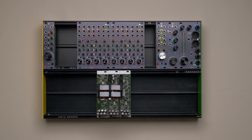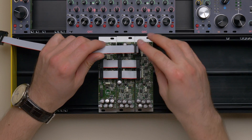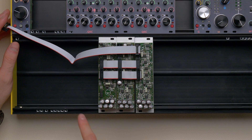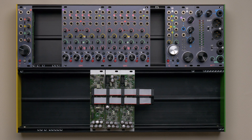Once the channels and groups are connected, they share audio, power, and controls through the link cables, so it is sufficient to connect just one channel per group to the power. As you can see, the group is the only module that doesn't have a power socket — it receives the power from the channel modules. In case your link cables have more sockets than needed, no problem, feel free to leave them unused.